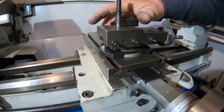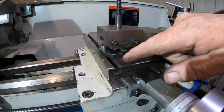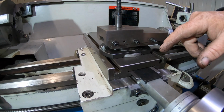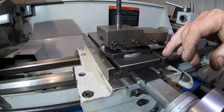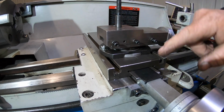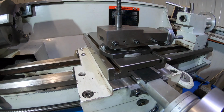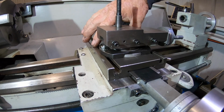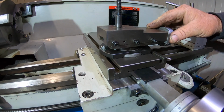Quite a few people have done a modification to the clamping system. Now these are a plate with 4 bolts in it. So I've drawn up a plan, which I'll take you over to the book in a minute and show you. But you do away with this black piece here, which clamps down on this ring. So I'm thinking it may help with the rigidity, having the footprints spread over a wider distance, a longer distance. I'm definitely hoping that's going to work.